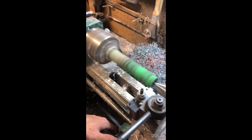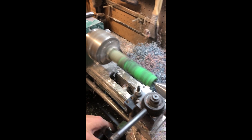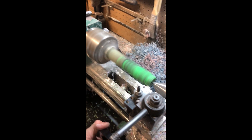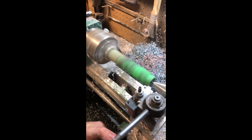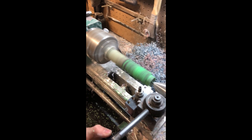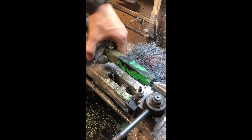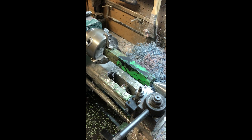I've had plenty of material come flying off the jaws at me, and it's not fun. So you're just going to keep progressively taking a deeper cut until you've just about got it round or have it entirely round. You're almost there — just want to do a little section like this. Your blank's not actually in there straight, and this won't work very well with a shorter blank. We've got a little flat spot there; let's take one more pass just to get rid of that.